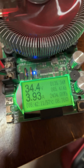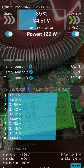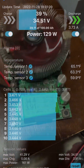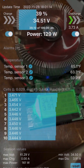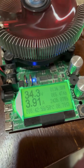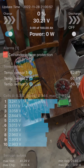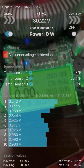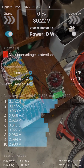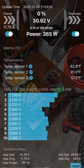More than 16 hours later, still draining this thing. Looking at the BMS, we're at 65 amp hours but we're draining it really slow — we probably won't get this much out of it when loading it up with a kilowatt launching a golf cart at a couple thousand watts, as the voltage will probably dip harder and shut the pack off. We actually managed to get 76 amp hours out of this battery and cell under-voltage kicked in and shut one off. Obviously we won't get 76 amp hours under heavier loads, but still pretty impressive. We're going to pop this on a charger, charge it up, and put it in the golf cart.